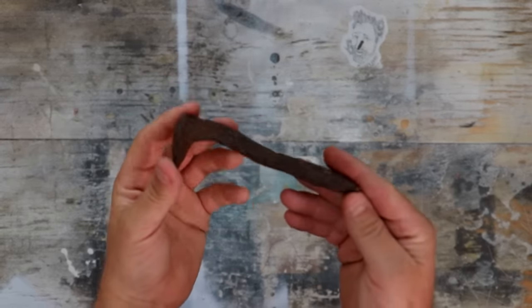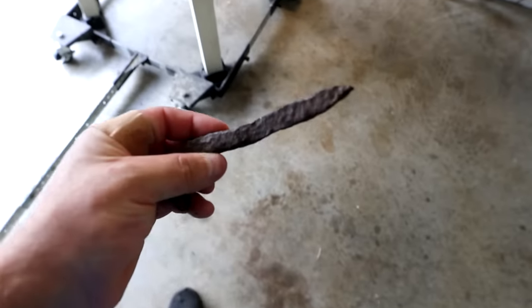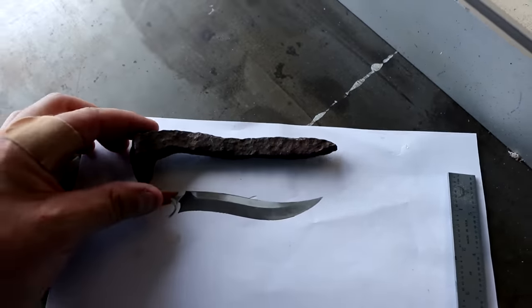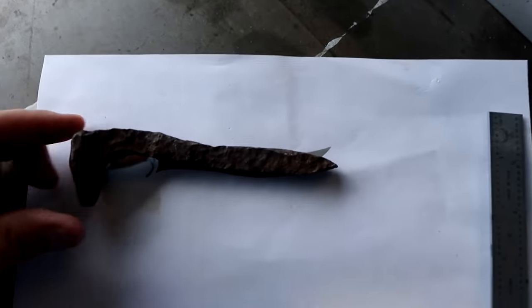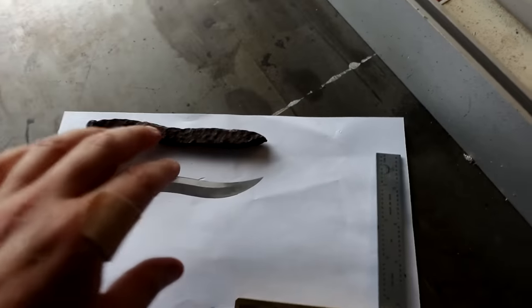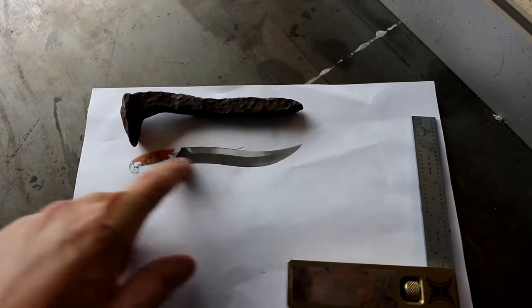Let's turn this into a beautiful little knife. In order to turn this into a tiny knife, we're going to do some forging on it because there's not quite enough width. If you look, the knife design sticks out on each side. So we're gonna have to basically squish this and flatten it out so that we can cut out this design